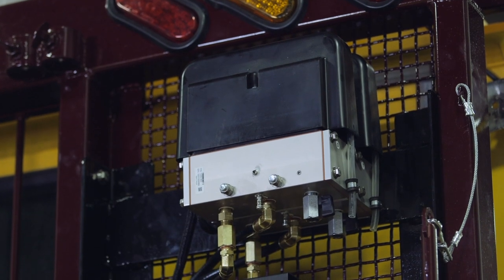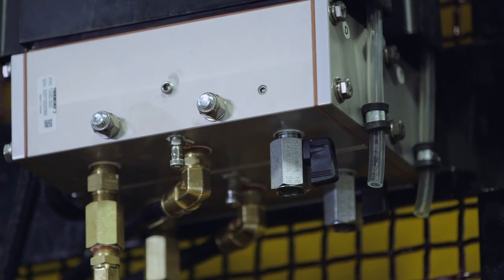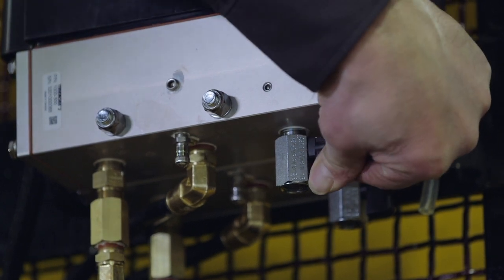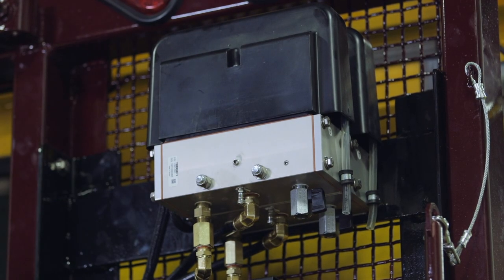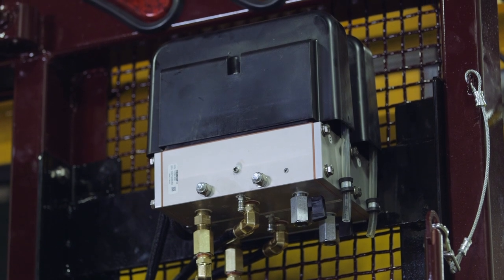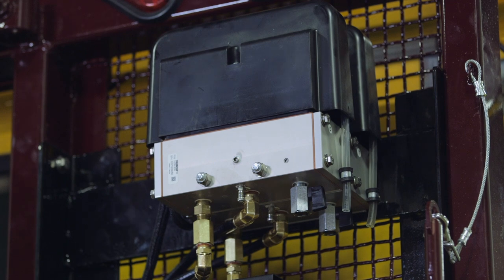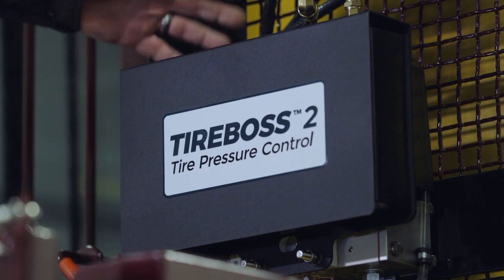The valve control unit, or VCU, controls the inflate and deflate of the tires — that's this whole assembly. There is an on/off ball valve on the exhaust port of the control valve, giving the driver the ability to close the exhaust port in case of a sticking deflate cartridge. This valve is to be open under normal operation. The Schrader port, located on the bottom or side of the valve, gives direct access to the tire pressure supply line. All tires in the group can be pressure-checked and manually inflated at this point, providing all wheel end ball valves are open. This control valve has thermostatically controlled heaters that will turn on if needed in temperatures near freezing, and most installations incorporate a protective steel guard over the electronics mounted on the front side of the control valve.